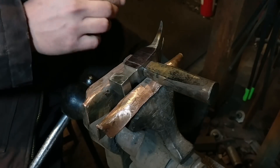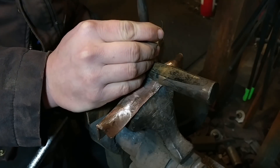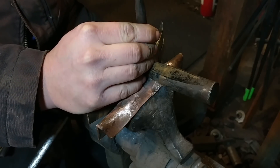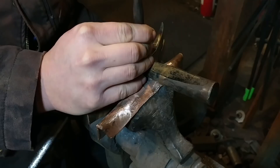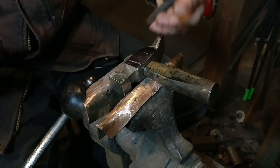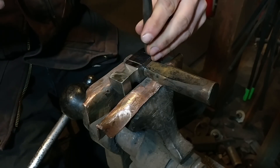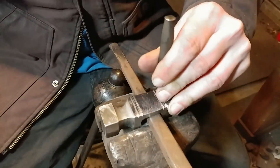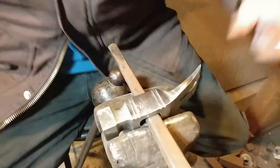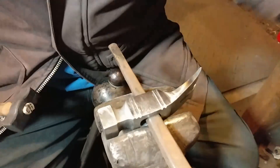All I'm doing here is running down this butcher — it's just a one-sided butcher — and I'm going to run it down both sides like this. Later I'll come back and do that again for a double pass. This will allow me to have a double set line which will leave me a little section in the middle that I can actually put roping into. This is what it looks like after I've put in the other line. As you can tell this takes a lot of hammer work but it can produce a really nice and keen result.